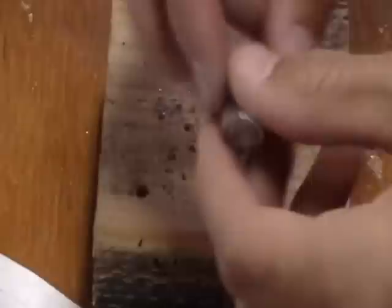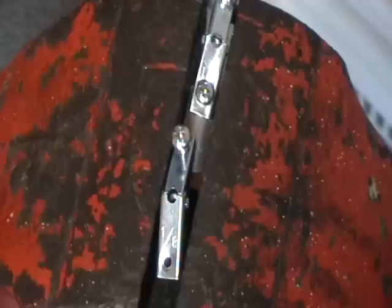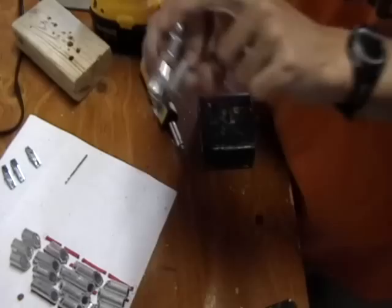Take a closer look. Now we're going to want to pre-drill one hole in the 45 degree end of this first joint. There we go. To avoid bending the toggle bolt, we're going to screw the screw into the toggle bolt and the aluminum rod, then assemble the pieces together. Here's the first completed finger.